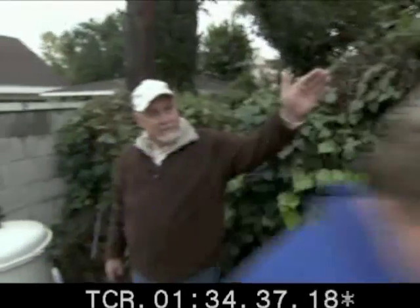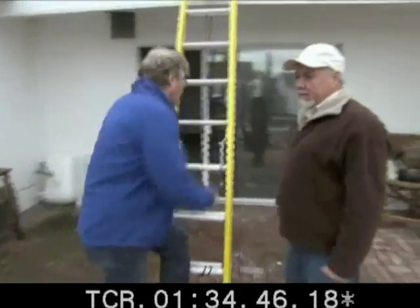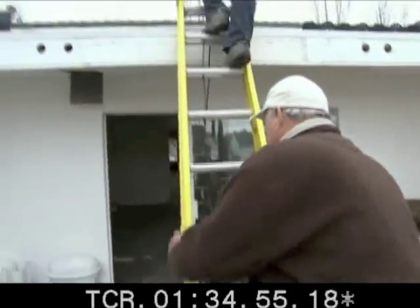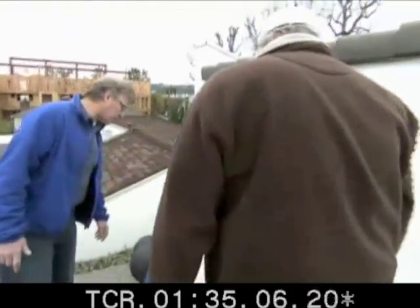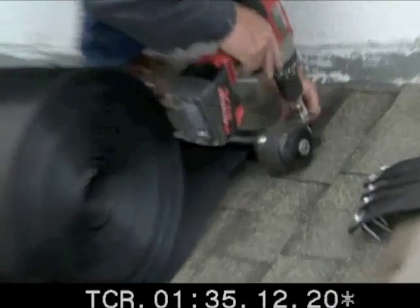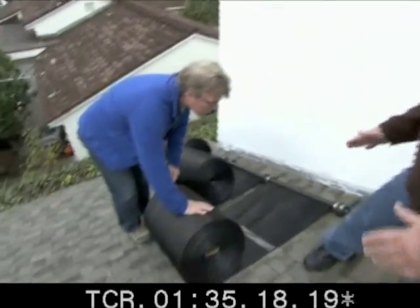This is a southern roof, which is your best exposure for solar. The system costs nothing to run because it uses the existing pool equipment. While materials and installation will run about $3,000, if you're already paying for a gas heater, a solar system will save you so much on heating that it'll pay for itself in about a year and a half.